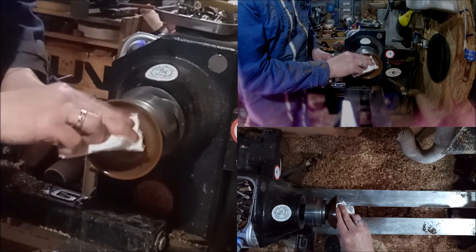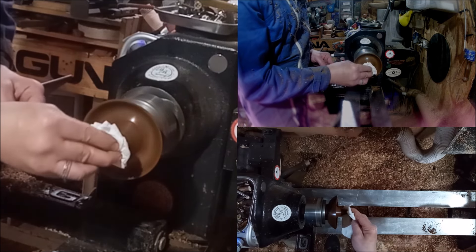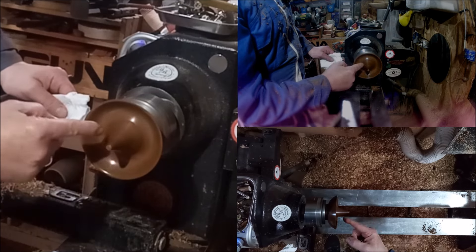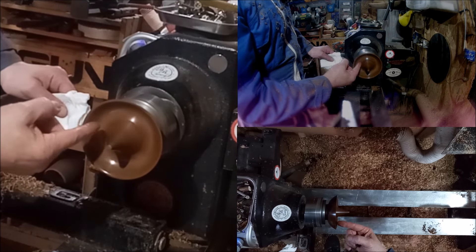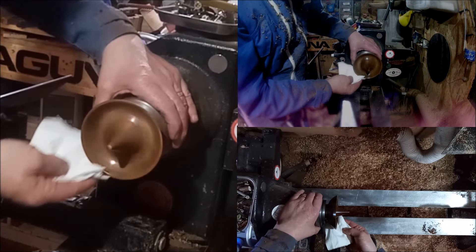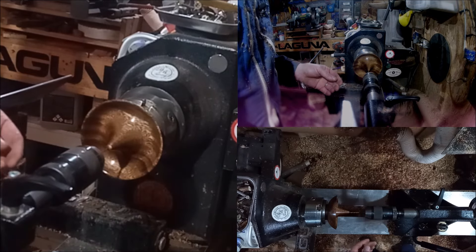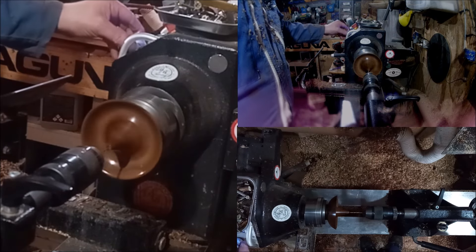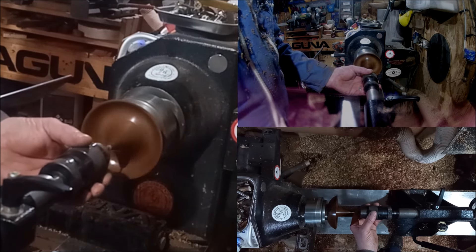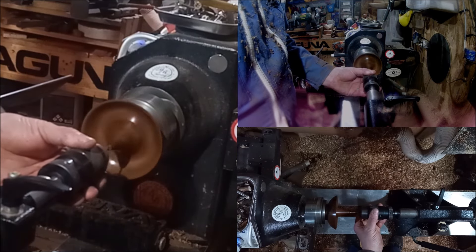Alright, just popping the wax off. As I said at the start, this just combines a few of the things we've learned in the series, with that extra bit of hollowing backwards. Now one of the tricks to doing these is to try and make that transition underneath smooth — don't just go down square and square everything off, it just doesn't look right. So there's that part, and the last thing to do is drill a little hole and straighten the top of that volcano-ish part. Now, drill the hole last so that you don't fill it with finish.